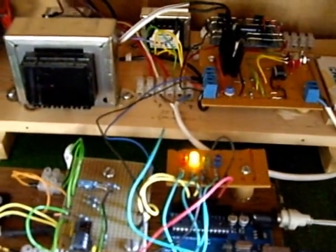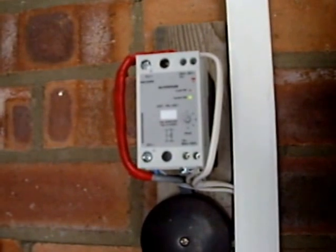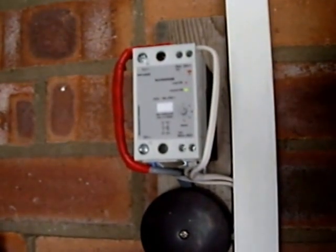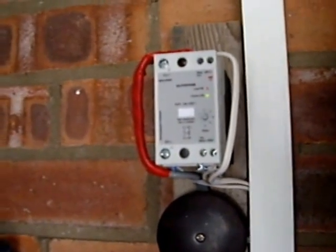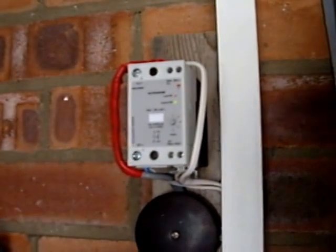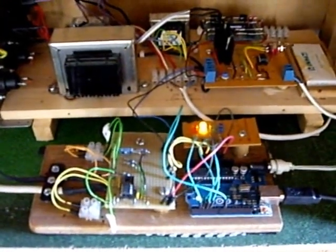We have an Arduino, and behind it we have a little board which shows how much power has been routed to the immersion. We have four lights: red, yellow, green and blue. The yellow means we're in the second quartile, so on a three kilowatt immersion heater system that means we've got something between 750 and 1500 watts normally going to the heater.